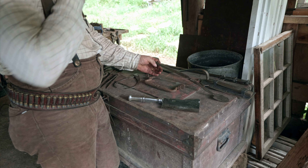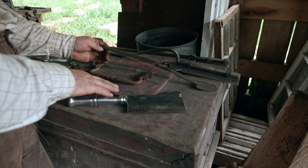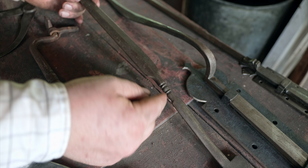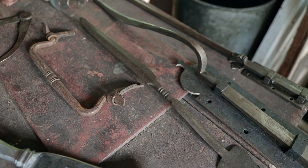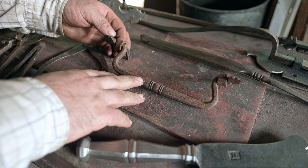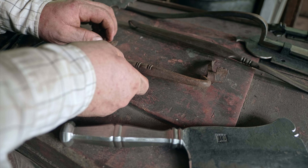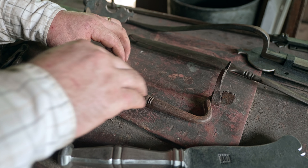This is what's left of about a 200-year-old spatula — it's been worn down to nothing. This was forged and then finished with files, completely bright when it was done. Recognize this little decoration here? This is what we just got done demonstrating — you can see it goes all the way around. If you carefully clean a piece, you can sometimes still see the file marks in those decorations. This is another piece — an old chest handle. Most of the piece was filed completely bright, and you can see these decorations; it's also filed in an octagon. But they didn't carry the motif all the way around the backside where it wouldn't be seen — no real reason to — but it's very visible on the face.